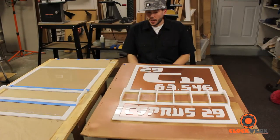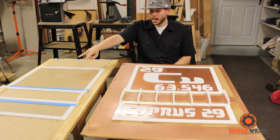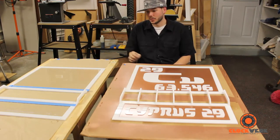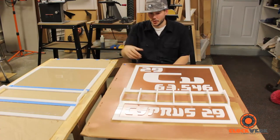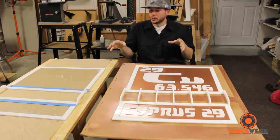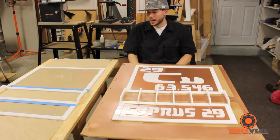Here we have the door panels side by side. I just have to cut some more bridges - you've already seen how I put those together. These two pieces are glued on and I'm trying to divide up the exact spacing to get them within a couple thousandths of exactly where they should be with even spacing for nine bridges. I'll be doing the same on this panel. Next shot you'll see them bolted up on the case.